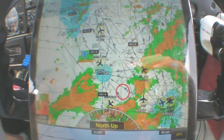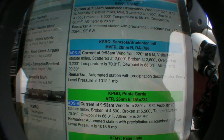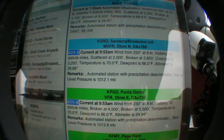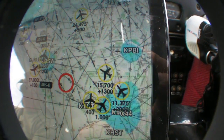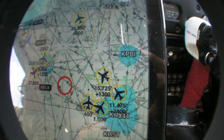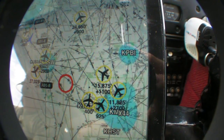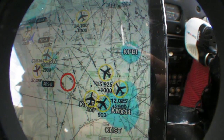Here's what the weather text page looks like — all indications of relatively recent ADS-B weather. As far as traffic, it receives on two frequencies: 978 and 1090. The airplanes you're seeing here are actually high-altitude traffic — what we're seeing are 1090 transmissions on the extended squitter. That means you're not necessarily going to see all traffic around you, either Mode C or Mode S. Keep in mind this isn't a complete traffic system — it's not like TAS.